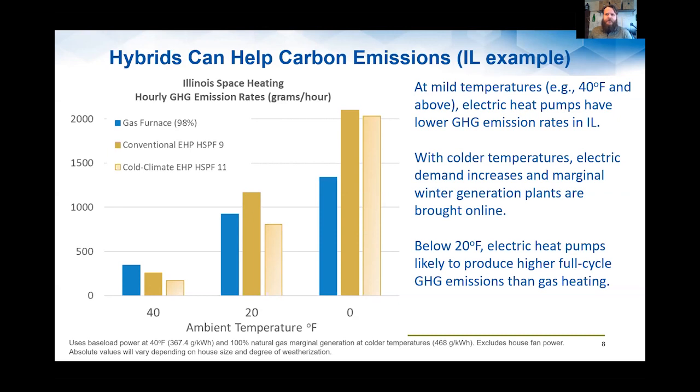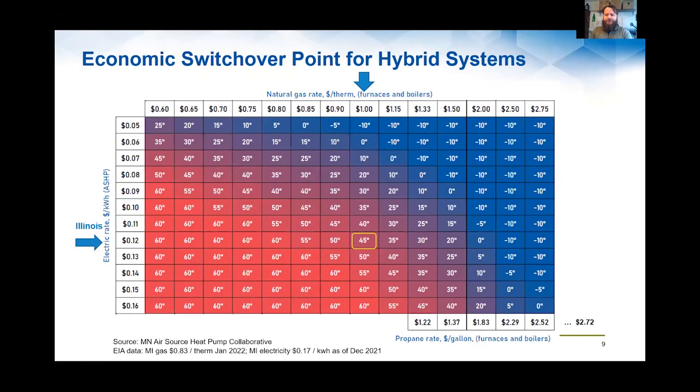And I've had some consulting clients do this on new construction, from a resilience perspective, and being able to have like a propane backup if needed with an electric air source heat pump for those homes that are concerned about reliability of the grid, and having some on-site storage through a battery coupled with the ability to pull in that propane or natural gas for backup.